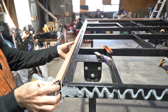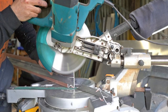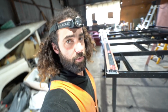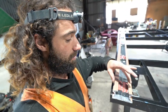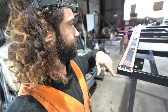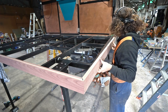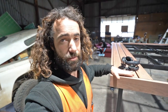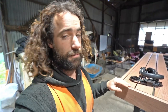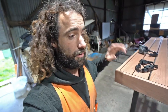We're almost back to square one. I've notched the boards, cut the mitres on the corners, and now I'm just gluing some packers in and then gluing the packers to the frame — not an ideal fixing situation but it'll be fine. Got the edge pieces on and now I'm starting to cut the decking in. This aluminium decking is so easy to fix down: it's really straight, you don't have to wedge it out like timber decking, and you don't drill through it for fixings either — there are just clips that go in between each piece that hold it down. I'll probably glue them as well just to be safe.